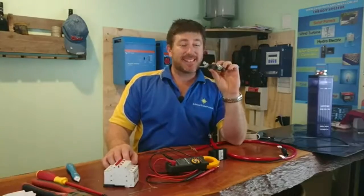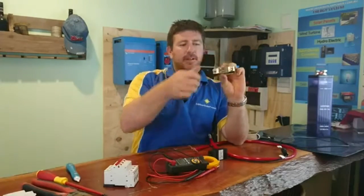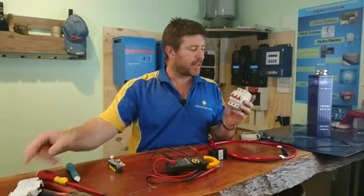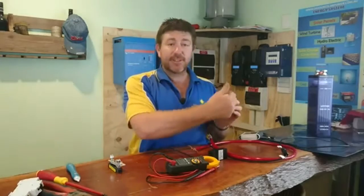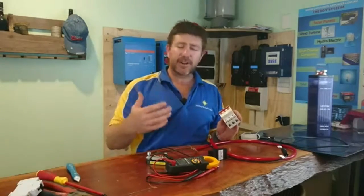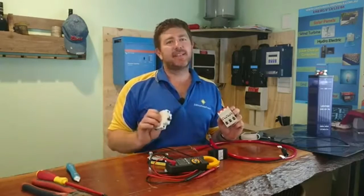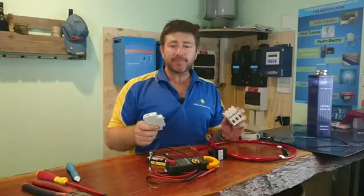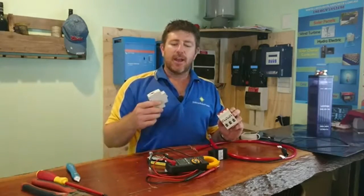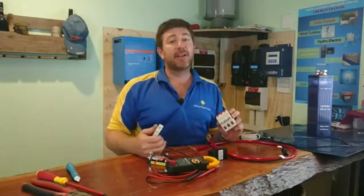Fuses — you've got a couple of different choices when it comes to safety. Fuse everything. These are quite big; they're 500-amp fuses, that's the block, and the fuse jumps in there. You can use fuses or you can use breakers. Breakers come in AC or DC versions — this here's a three-pole breaker, so it's three different circuits all in one. Use whichever is most financially viable for your situation. You can actually use AC breakers in DC systems if you know the exact specifications; big companies have been doing it for 20 or 30 years. DC breakers at lower voltages and higher amps can be really expensive, which is why AC breakers are a cheaper option.